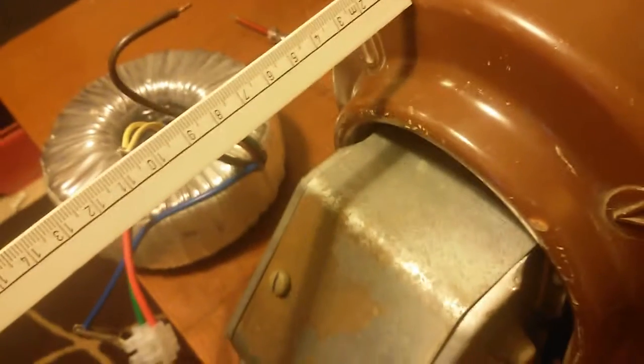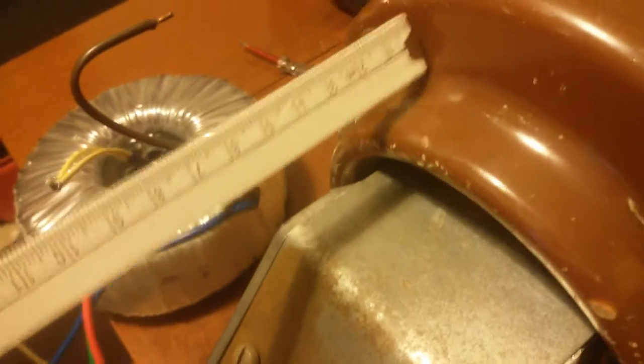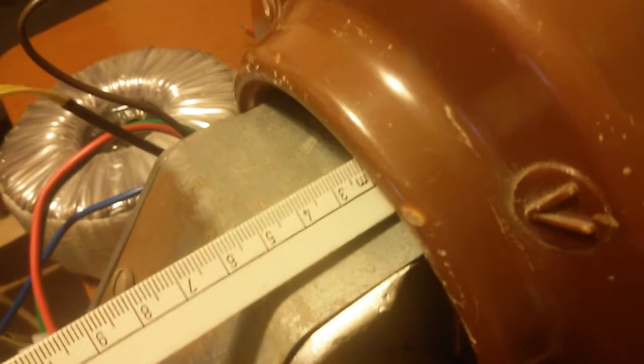The coil is a little bit more than 14 centimeters, and the coil-to-core insulation is nearly three centimeters — actually measuring it that way as well, it's nearly two and a half centimeters. Here's my chicken stick — and there are just those marks on it. Let's see if it works.